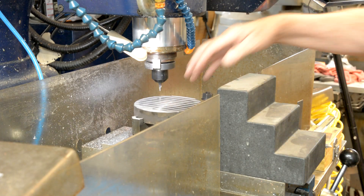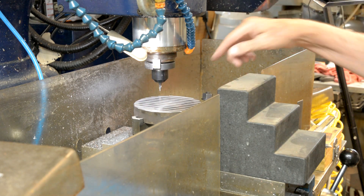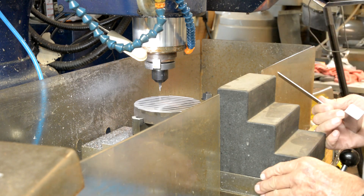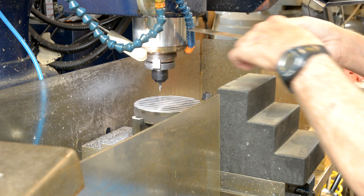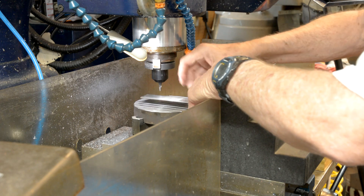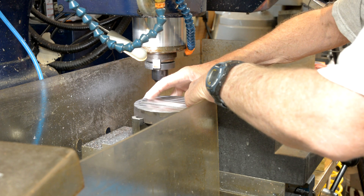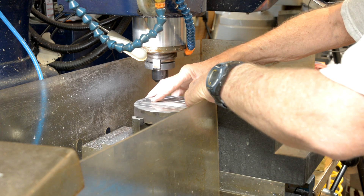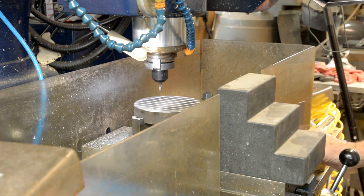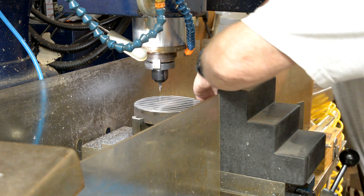To square up my cuts on this block, I have to rotate it. I don't want to mess with the angle of the tool, so I just stick a granite 90 in here, hold my precision square, and then just sight down the line to get it nice and square. That looks really good, and just tighten up the chuck, and we're going to go the other way.